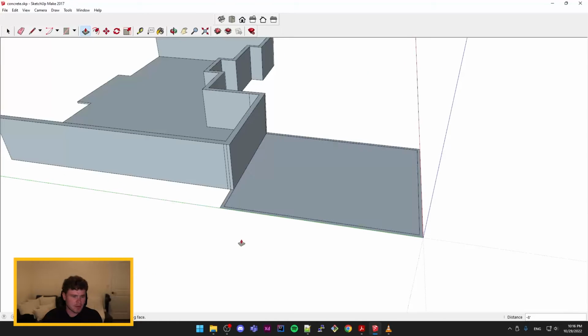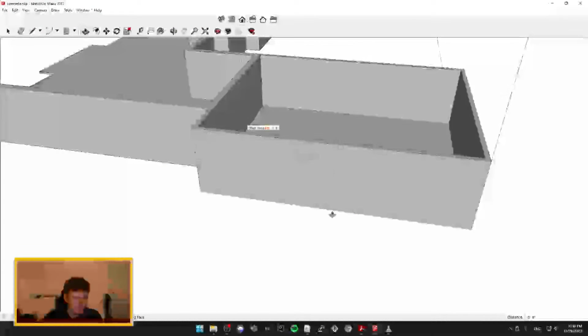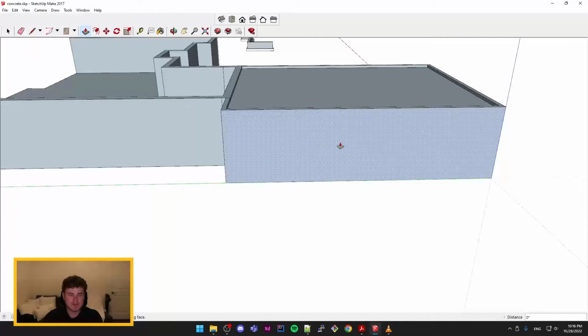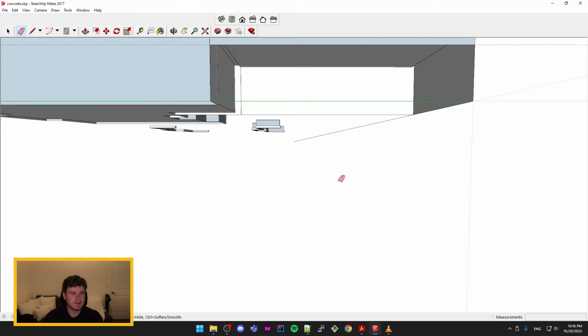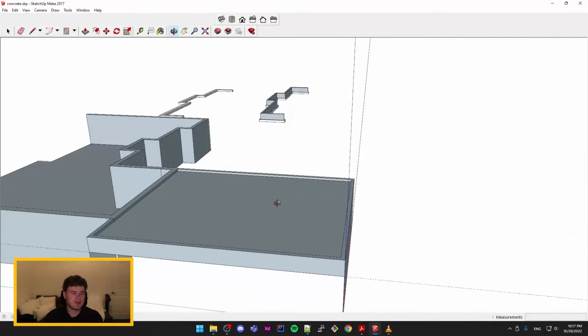So the last part of our concrete here, let me bring this up to 8 feet. 8 feet 4 inches here, and let's say it's going to look something like this, but we're not going to have an 8-foot foundation wall. So let me, I can't bring it down. It's going to be 2 feet, so it'll be something like this. So let me measure out 2 feet. I'm not even sure if I'm using the software correctly, but it's been super handy, even the way I am using it. If it's incorrect, it's been really handy using it this way. So it'll be like this. So we're going to bring in a bunch of dirt, compact it, and then this will be the last part here. This will be the garage.